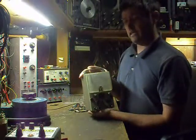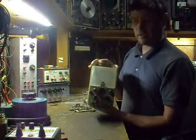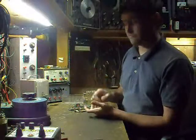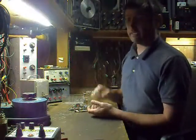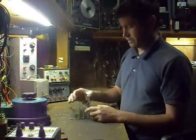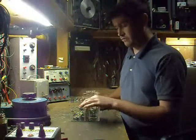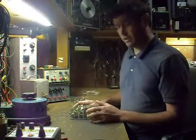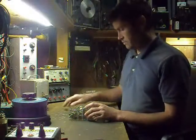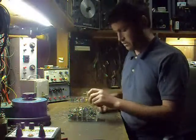And finally, the meter that goes across the diode to determine what its actual breakdown voltage is — when it can tolerate voltages around 1500 to 2000 volts. In this situation, I'm using a Heathkit vacuum tube voltmeter which has an input rating of 1500 volts. I'll lash up the whole thing ad hoc here to let you see the quick and easy setup you can make for testing breakdown voltage — just parts off the shelf. If you're going to be doing a lot of this, you'd probably want to make a permanent bench-mounted unit with just two terminals to hook up to a diode under test.